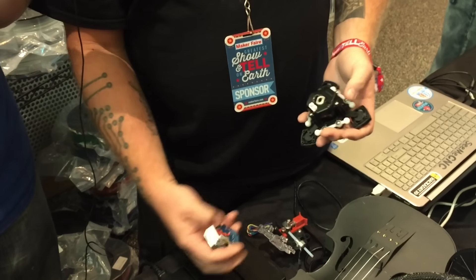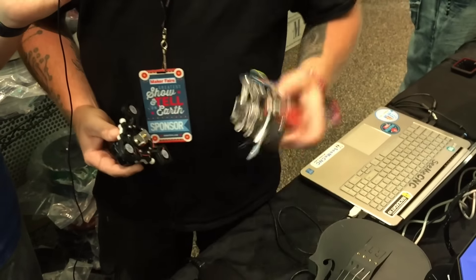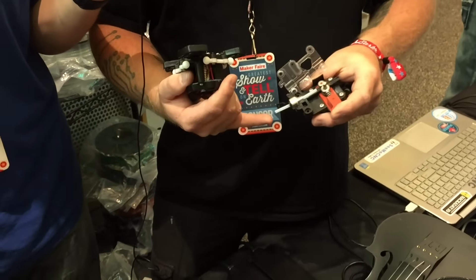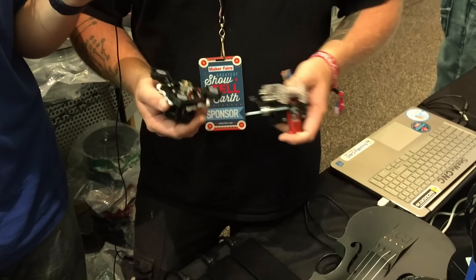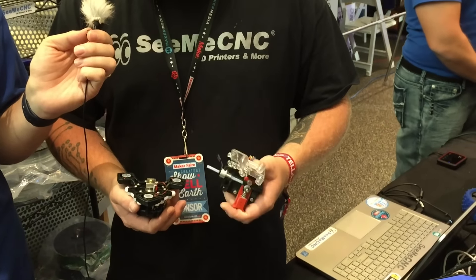The biggest improvement is we've got the calibrating hot end that features the accelerometer probe, as well as a new extruder design — we call it the EZR extruder. It works much better with flexible filaments so that you can do Ninja Flex, the Cheetah. There are a few other TPU or flexible materials coming out with some softer and some firmer options, so we designed the extruder to work with as many materials as possible.